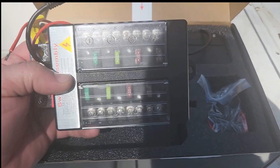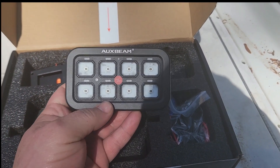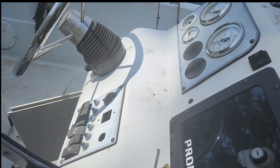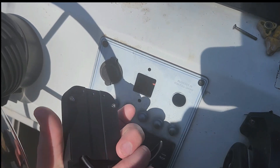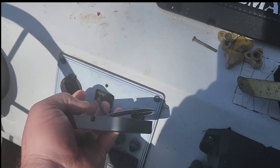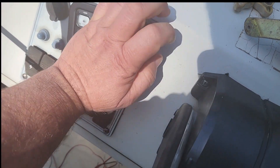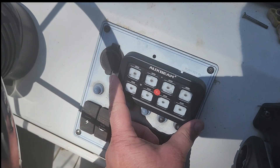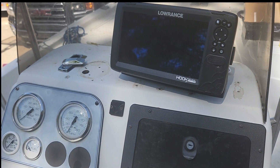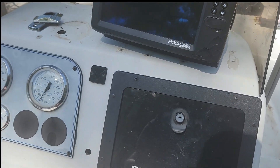We have the relay panel — a fused relay panel. Another reason I went with this instead of others: the switch panel should fit right where I already had holes, so I have all the switches I need. The fish finder was literally wired directly to the battery in the back — not good. It has a fuse but it always has power on it, and I wanted to put it on a switch.